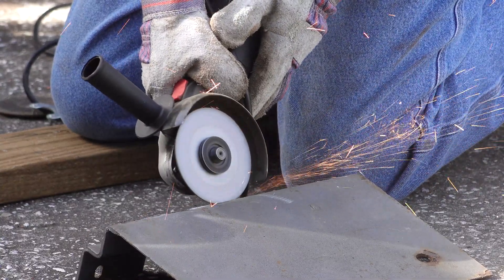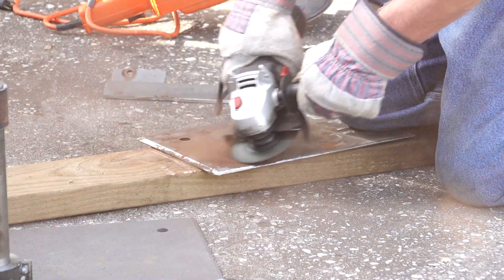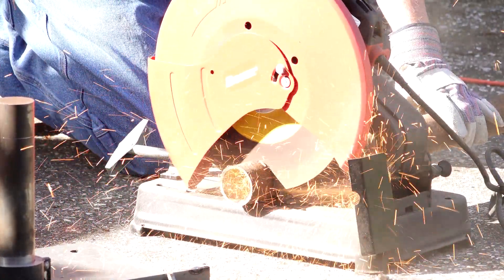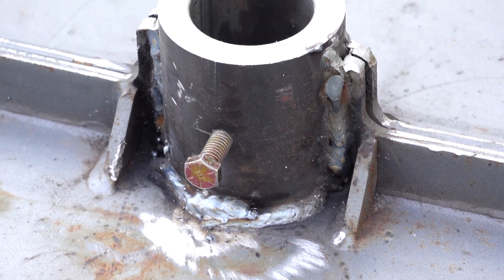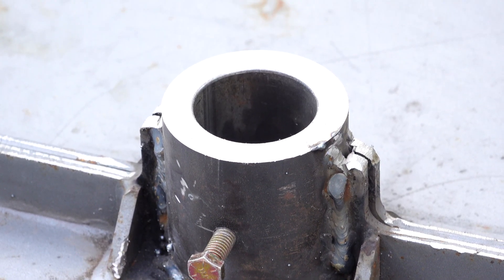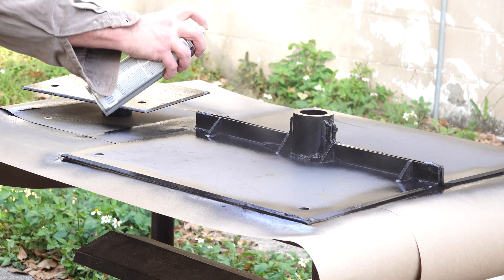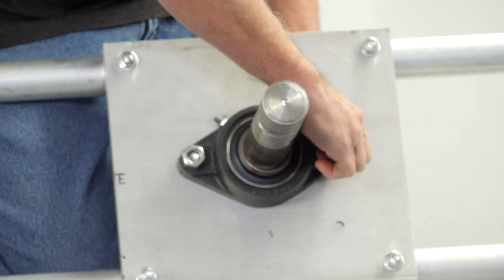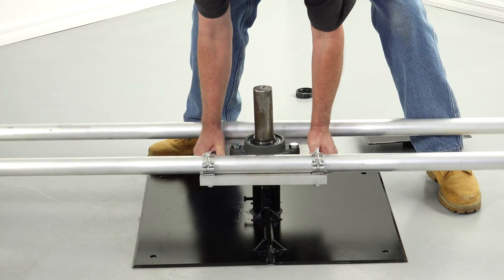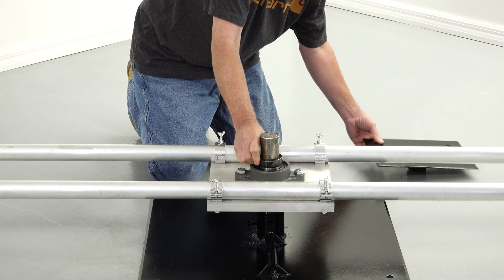Temporarily for the top plate, I used another piece of scrap metal and cut one side off, then ground it down and attached it to a 3-inch long piece of standard 2-inch schedule 40 pipe. For a better top plate, I ordered another piece of the same pipe that I used on the base plate, so I do plan to make a sturdier top plate once I have that piece. I cleaned up the plates a bit with a grinder and then gave them an even color with some black spray paint. Then I just had to assemble all the pieces. Total cost, not including the two 10-foot pieces of speed rail, is just over $200. And since you never pay me, there was really no cost for my labor.